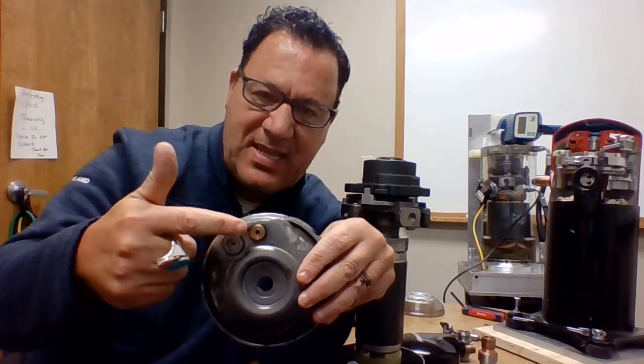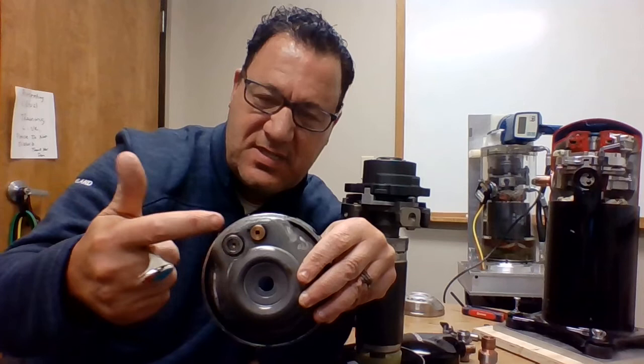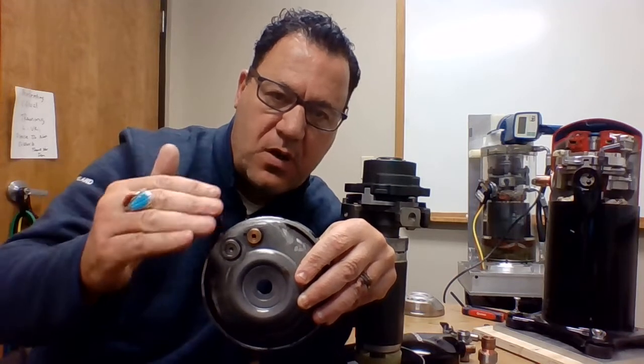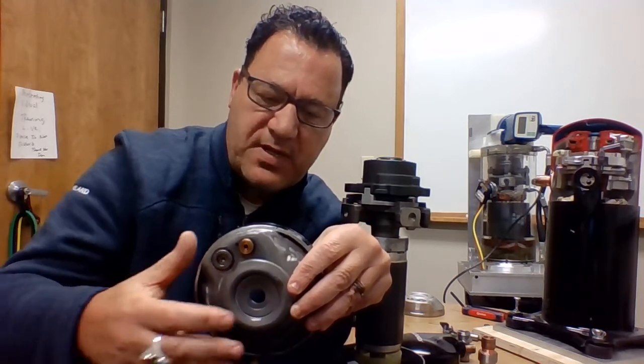You'll notice in any AE bulletin that you read, depending on the model, that the TOD is going to go off typically somewhere between 260 and let's say 280, always below that 300-degree mark where we start to lose our lubricity and cause friction inside the compressor.